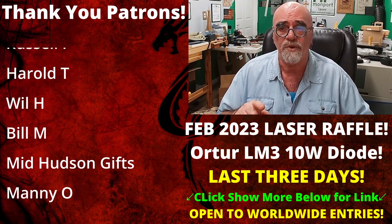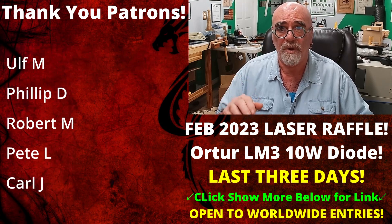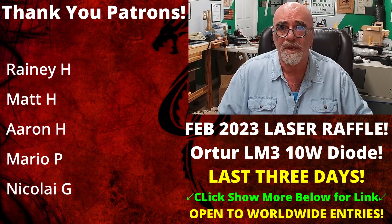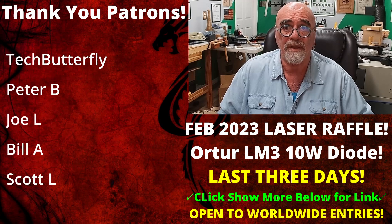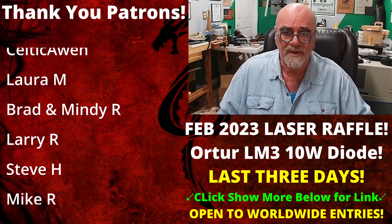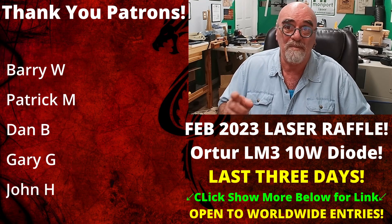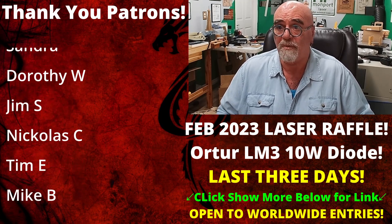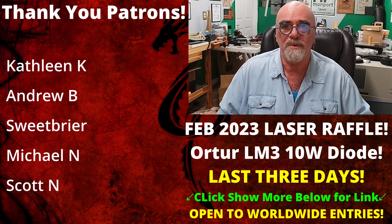You'll never overdrive that tube. I did field service for a while and replaced a lot of tubes. People with 100 or 150-watt lasers that didn't do their research would watch YouTube videos saying to run at 100% power, and a month later the tube was dead — a tube that should have lasted 4,000 to 5,000 hours. When I'd get there they'd say it must be a bad tube. One was a Reci tube — the best on the market — and the problem was they had overdriven it at 100% power. He said, 'Well, that's what everybody on YouTube said to do.' Take everything with a grain of salt and do a little more research.